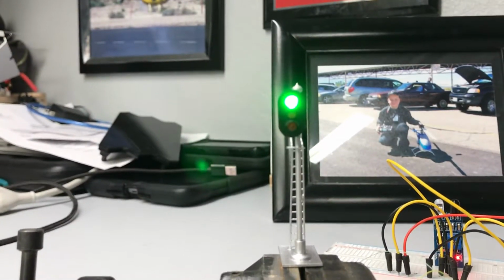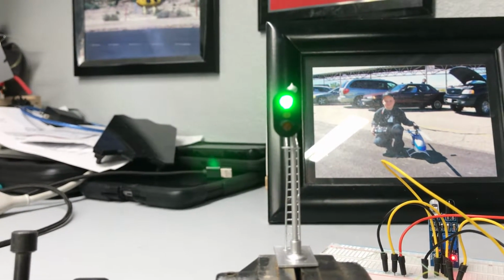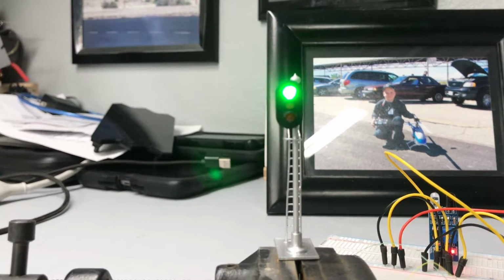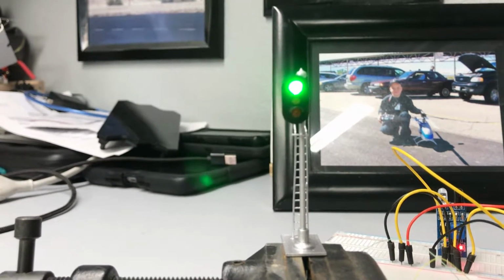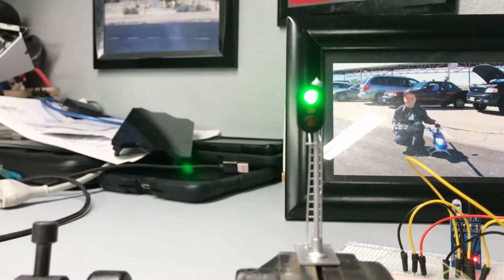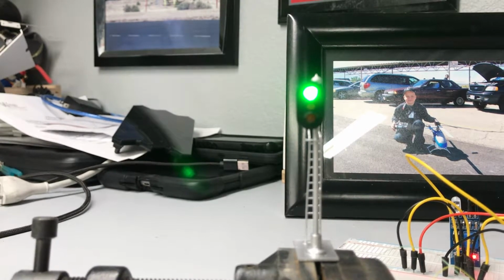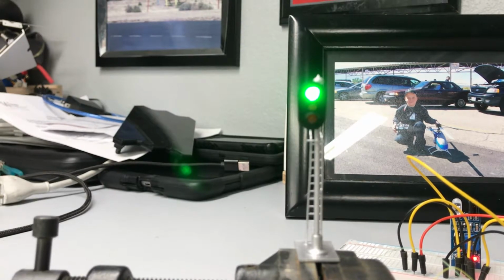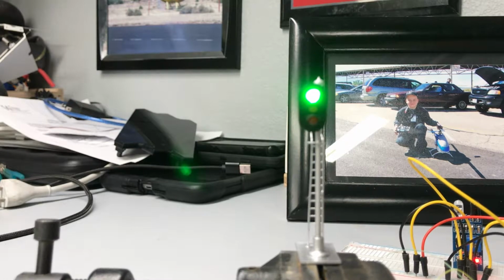Anyways, this is a railroad signal, and right now the signal is showing green because the section of track beyond this signal would be green or clear to enter. What the non-railroad types may not know is that all the trains are operated in control blocks, so we don't have any head-on collisions. Sometimes they'll move off the main and go onto a passing track and let another train pass or whatever, but this signal controls all that activity.